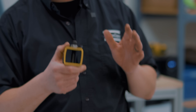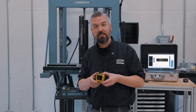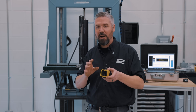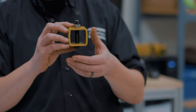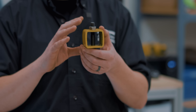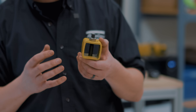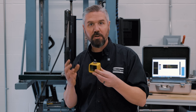It's much better than the thin tube — the thin tube didn't even stand a chance. This one at least still has some of its shape left. If you haven't seen the thin wall tube video, check out the link in the description, but it was much more carnage than this. But still, here we've got a problem: we've only generated about 7,500 pounds of clamping force and we're expecting about 12,000 pounds. That's due to the plastic deformation happening during the tightening operation.